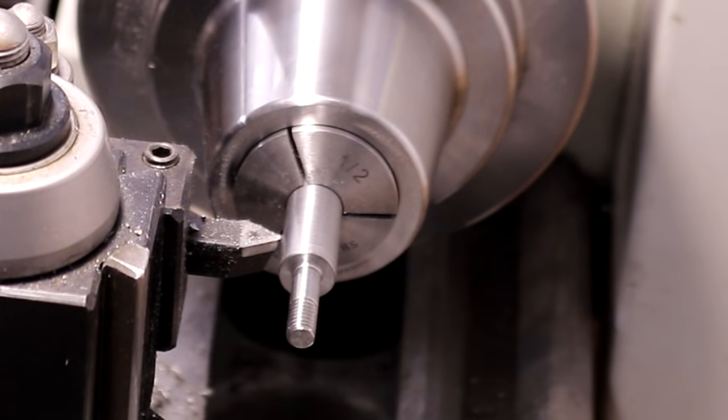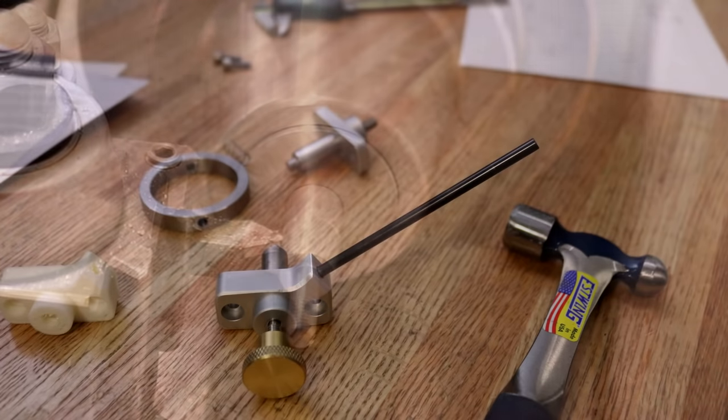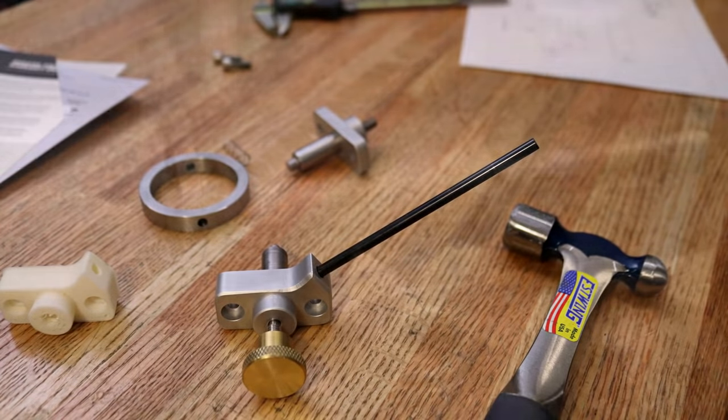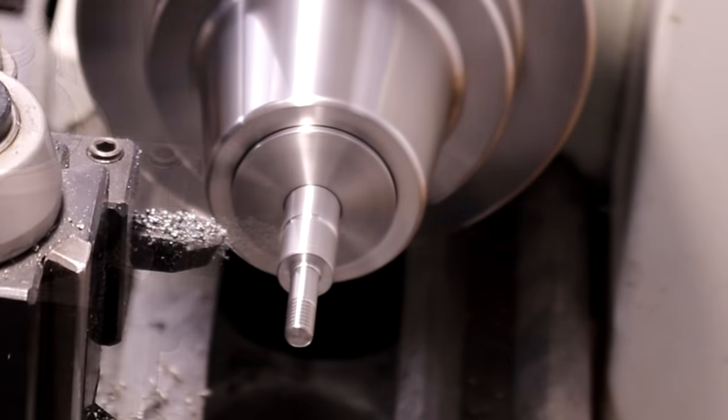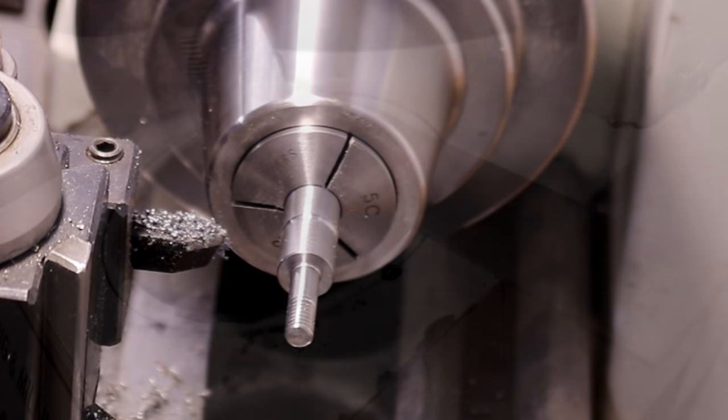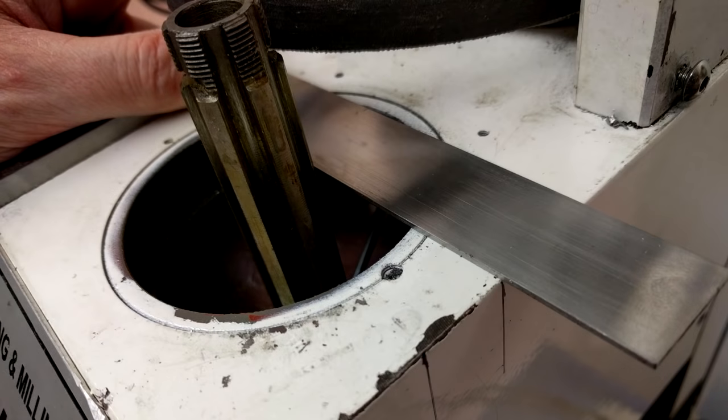The position of the detent is important, and we can get an exact position by using a transfer punch through the main body onto the pin. The depth of the detent is less important than the preload of the plunger switch. There's a pretty narrow acceptable range and too much pressure and the switch can be damaged.